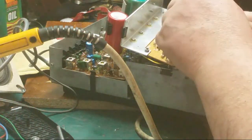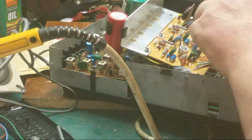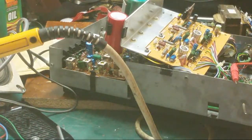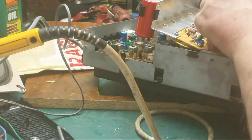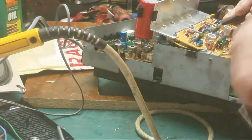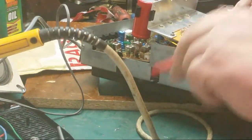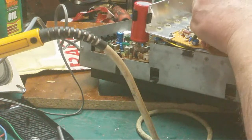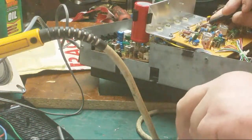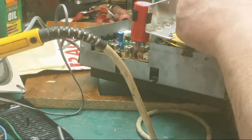And also, that resistor there is gone. Not actually a resistor, it's a diode. Let's see if it's sure. It looks like a resistor. Pretend it's a diode. Let's see if that's short. See, that's what's happened because the rectifier's blown, you see. Yep. It's not reading. That can't be any good, surely. It ain't reading.